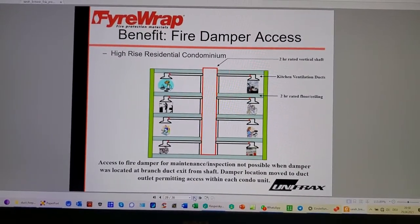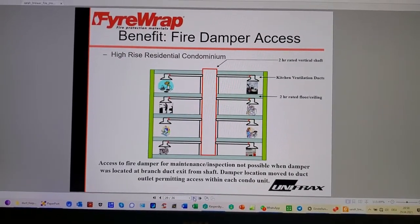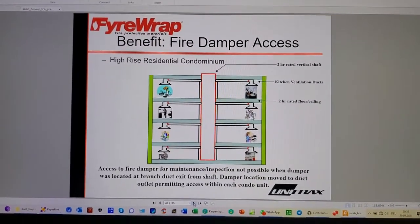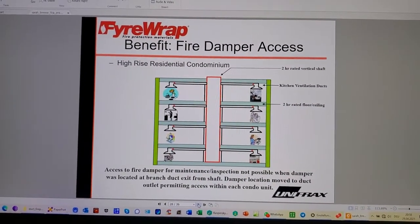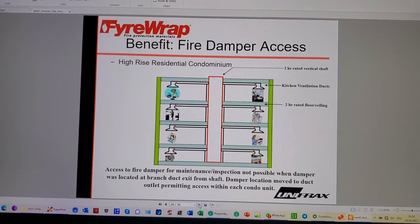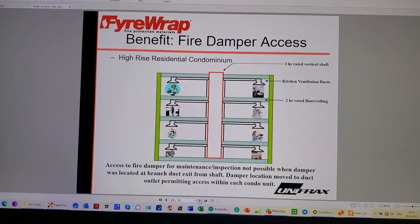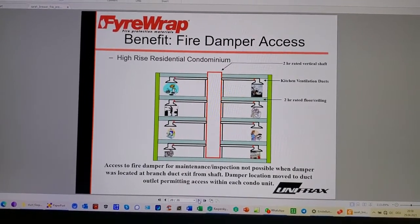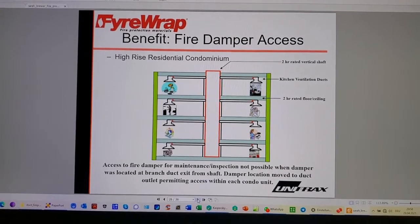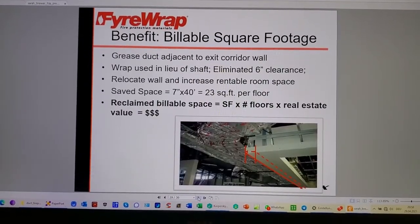If it's pressurization ductwork, you're sending cold air through to the protected area. Why would you want to damper that? Well, maybe because your duct fireproofing is not really the equal of the conditions of acceptance of E119, which is what the code intent is.